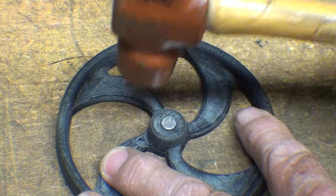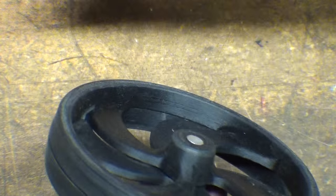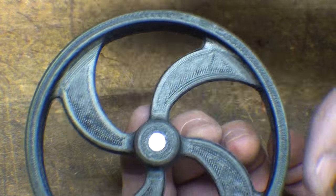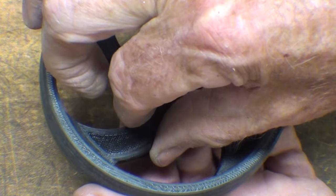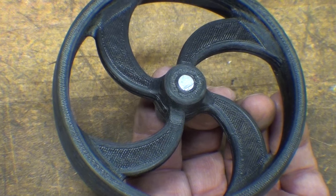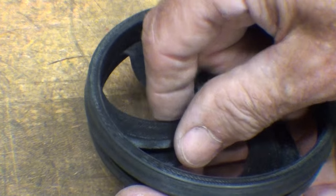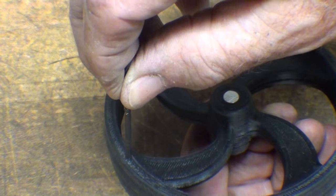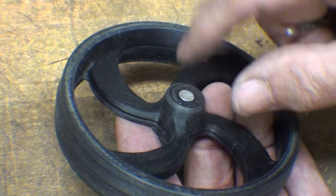I plugged the remaining hole with a short piece of aluminum rod, tapping it in trying not to make too much noise. I told you I need another pin of some kind so that the pattern is registered properly — not twisted one way or the other. The spokes are so thin I won't do it on the spokes; I'll do it out on the rim. I'll drill a 3/32nds hole all the way through the first piece and about halfway into the second, then use a piece of 3/32nds filler rod to make a pin.